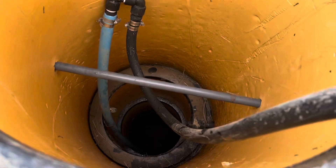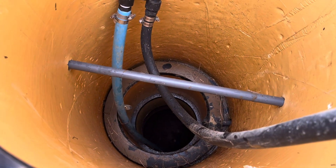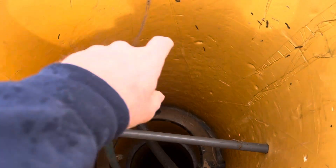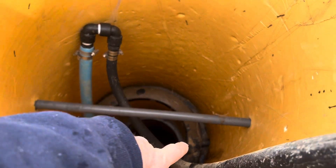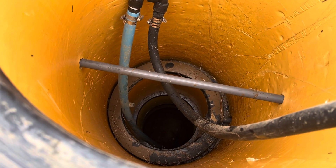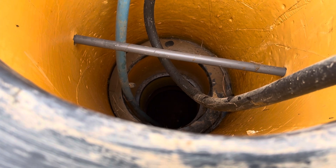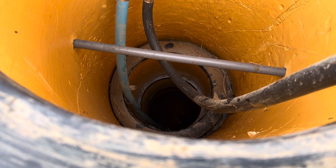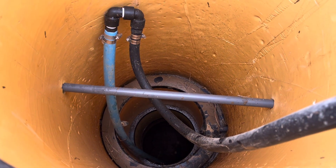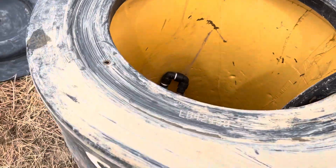You can see all the way down — we dug basically close to about 10 feet down. There are two tubes. This top tube is where it comes together, with these pins on the side, and then there's a longer tube. There's insulation — I would say about another eight feet of insulation — then there's a bottom tube that's four feet. So there's probably insulation going at least six feet into the ground, below the frost line here, and then there's a tube that comes out.